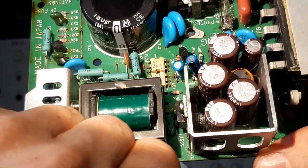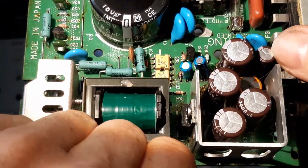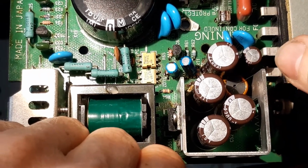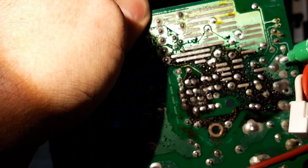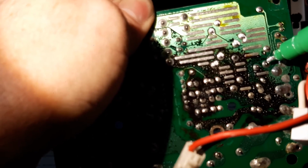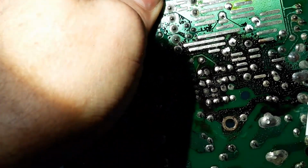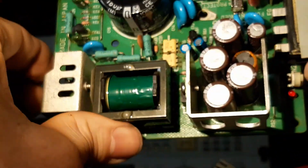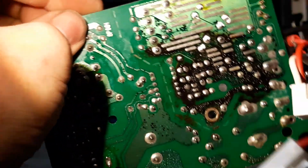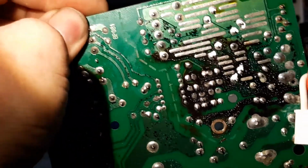And then the last of the larger rated capacitors is down next to these small caps on the left and the 35 volt cap on the right. So level with just below the first terminal of the cabling. So let's invert that. There's our first terminal. These are probably the legs for the 35 volter, and I would say that these two pins here are the pins for that final cap. So let's just have a look at them. Yeah, see, that's actually offset from that line, slightly to the right. Yeah, so I'm pretty certain it's these two here. Let's mark that up in the swamp.